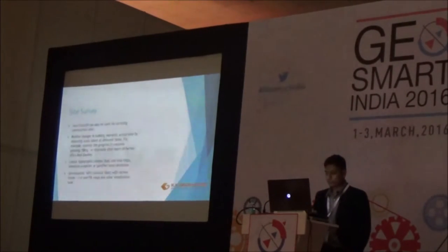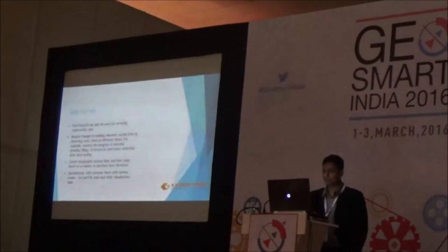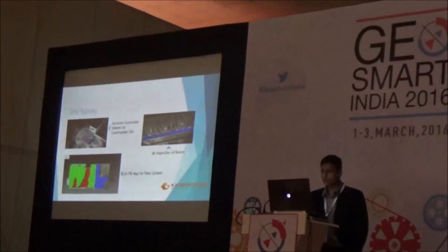Then comes the site survey. For this we use a snap-in called Builder or the Gexcel GRC 3D Reconstructor software. In site survey we can monitor building element changes over time — concrete grinding or filling, structural beam deflection after deck loading. We can create topographic contour lines, cut-fill heat maps, and also get excavation volumes for sites. Examples shown include excavation volume calculation for construction sites, beam inspection after deck loading, and cut-fill maps for leveling ground.